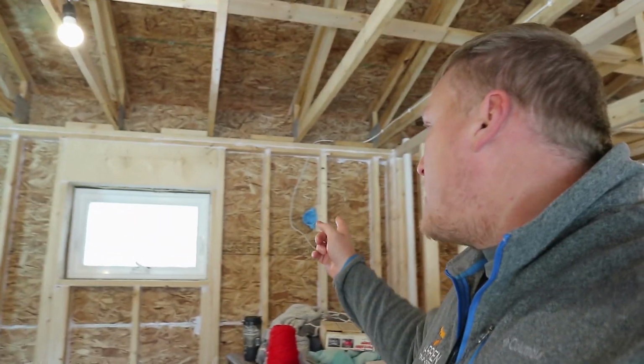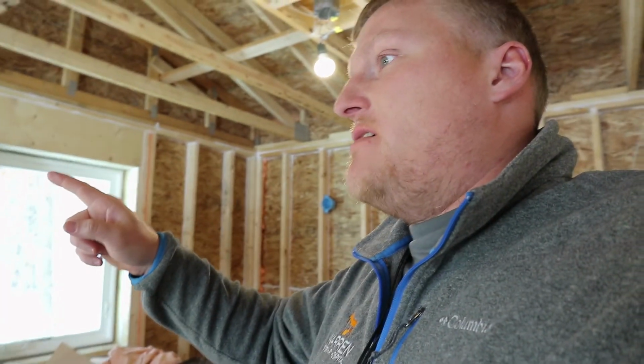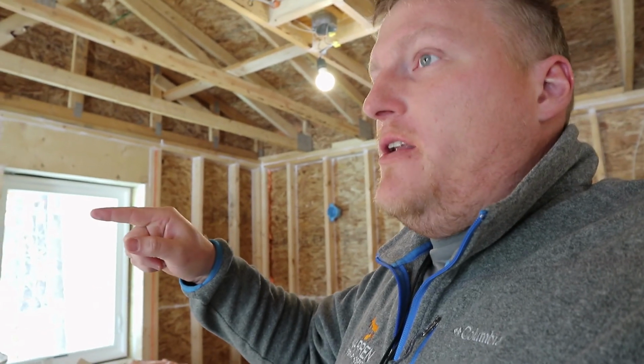because the sconce there, well, that one's shorter under the window, but a lot of the other ones are shorter over the window. But I might just drill holes below the window because, I don't know, maybe I don't like working on a ladder or putting more holes in the thermal envelope, the air envelope. So I think I'll just put holes down through the walls in most cases. That'd be easier, faster, airtighter. A lot of places already have holes under the windows. I'll just use a little bit extra wire.